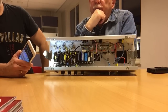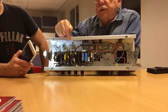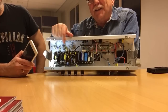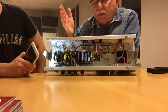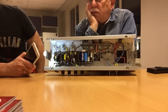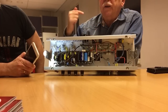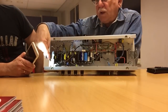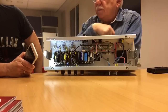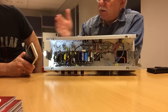One thing about wiring, or what they call lead dress. But mind you, this is the ugliest thing I ever made. My lead dress doesn't normally look like that. It looks kind of pretty to me. This is my proof of concept, a prototype. But in many amps you see the signal comes in, goes somewhere there, and then goes back there. It's asking for trouble. If you see a schematic, build it as the schematic shows.